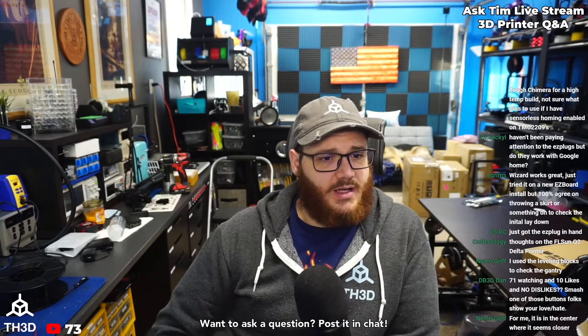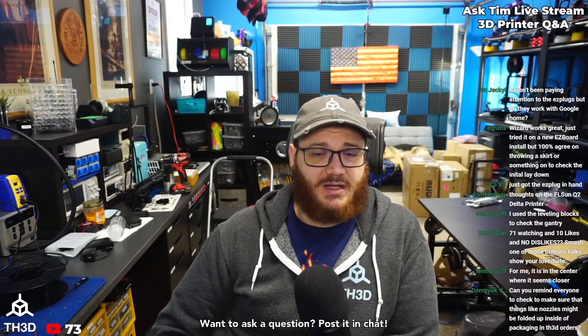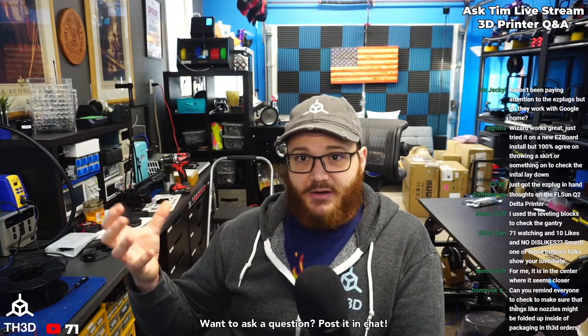Ken Corcoran, why in the Unified Forum do you say not to turn on heaters while probing unless directed to do so? That's a deprecated feature that's not in the newer ones. Because with ABL sensors, ours and BL touches and other stuff, you want to mitigate as much electrical interference as you can. One of the things that does that is we actually have the firmware turn the heaters off as the probe is coming down to take a reading. So it reduces the pulsing of those heaters. It also can help stabilize the power supply voltage, because those heaters aren't pulsing on and off, causing the voltage to dip a little bit.